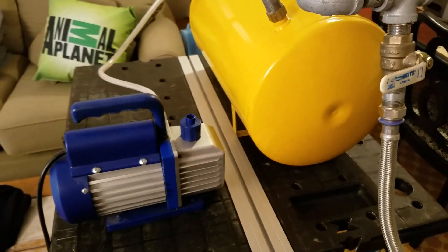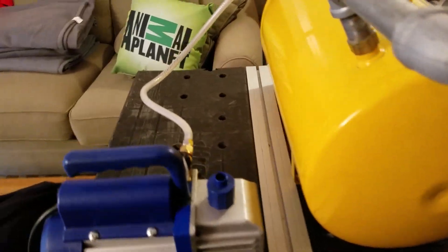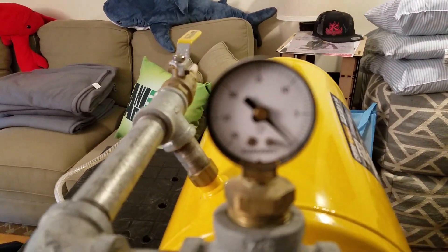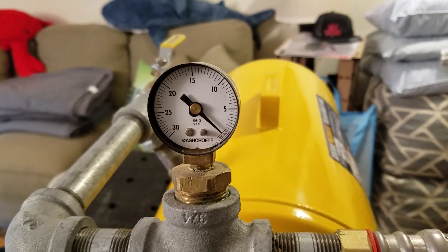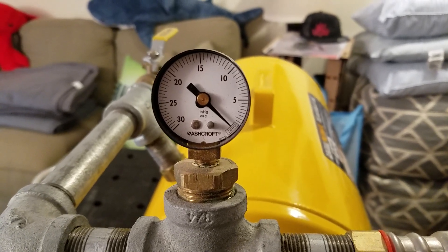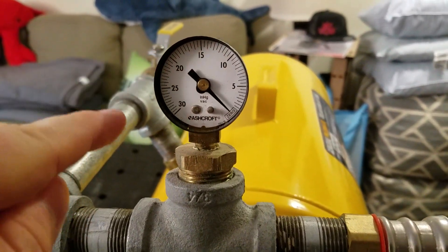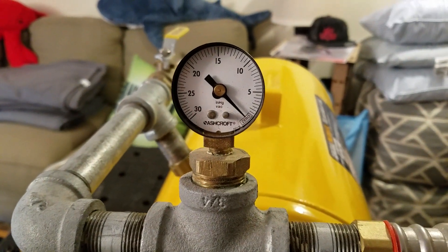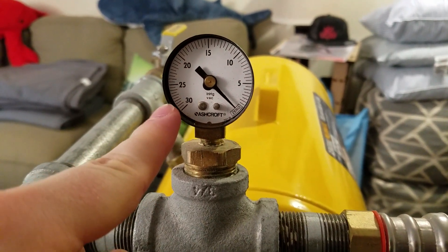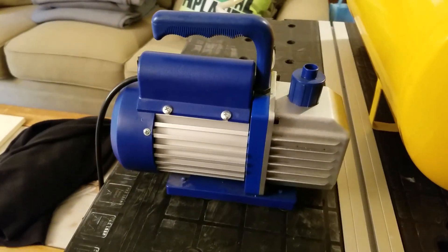When your plastic is heating up, you're already running your vacuum charge — you've turned it on and the air is evacuating out through here. I'll then watch my vacuum gauge right here, which reads in inches of mercury. You can start vacuum forming around negative 20 inches of mercury, but in my system I really like to go above negative 25. Most of my pulls are actually around negative 28 inches of mercury, or basically as far as I can get it. You want to make sure not to overheat or put strain on your vacuum pump.